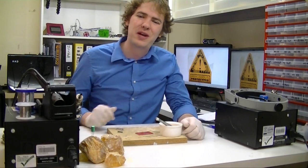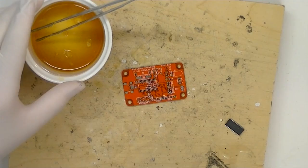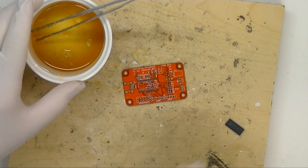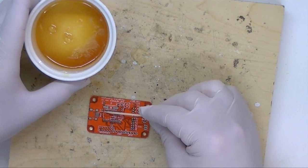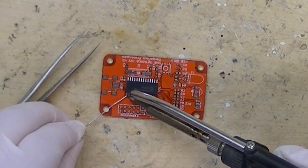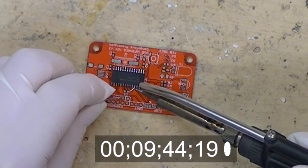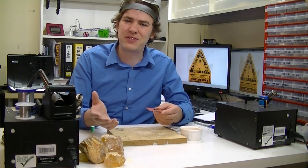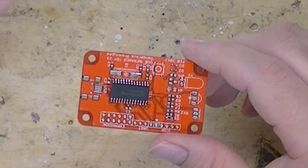The question is: will it work? We've got the 80% batch we made yesterday with just a hint of glycerin in it. We've got a circuit board and a 28-pin SOIC chip. I'm just going to apply a tiny bit with one end of a toothpick and then flip it over and spread it with the other. The corner pins went on okay — minimal smoke, hardly any smoke at all. The iron is a little hotter than it should be. Wow, that actually worked great as a flux — it didn't smoke, it didn't smell bad, and it didn't burn at all.